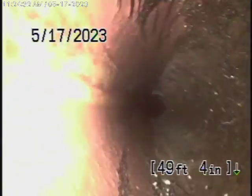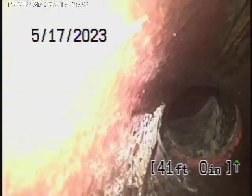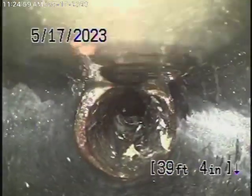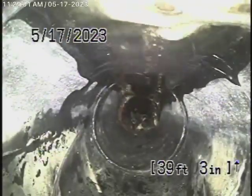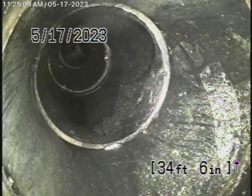This can all be cleaned from the clean-out outside of the house. As you can see, it does have some roots in it. Right over here is where it kind of exits the house. That's where the clean-out is. And then it comes back to ABS plastic — that's the clean-out right there — and then it comes underneath the house with ABS plastic. This all looks in good condition.